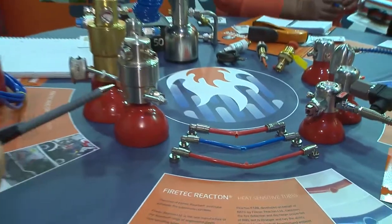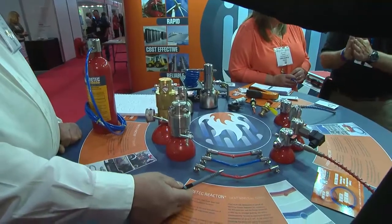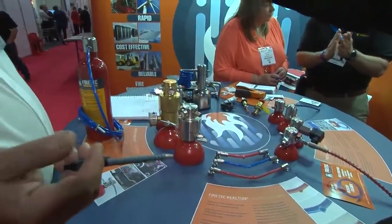What we have done as a company, we've developed this further. The original tube, which is the red tube here, is rather weak by today's standards and has a maximum exposure limit of 70 degrees C, after which it's liable to fail. And kitchen systems require something that can withstand steam at 100 C, and modern engine compartments have turbo engines which get a lot hotter than that. So we've actually developed this secondary tube ourselves, I have to say on behalf of NATO, whose engines get very hot because they're surrounded by steel plate.